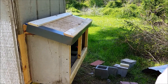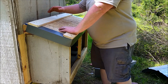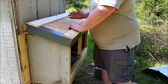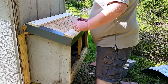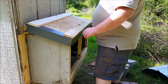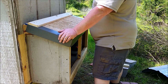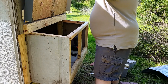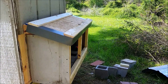So I'm working on a lid. What I've come up with is a lift-up lid — I cut me a piece of OSB, put some hinges on it, and screwed a piece of 2x4 up there. I put three hinges on the back — I've got all kinds of hinges left from when I refinished my cabinets and put new hardware on. I also had some flashing left from my shower job — there's a video coming up for it. I bent it around and put it all around the edge so it seals things off and lets water run off. Then I put pieces of 1x on top to hold the flashing down, and now I'm going to screw my metal roofing to these two boards. I think it looks alright.